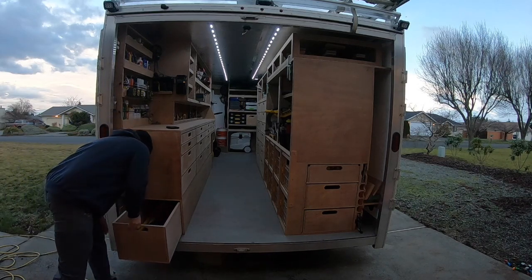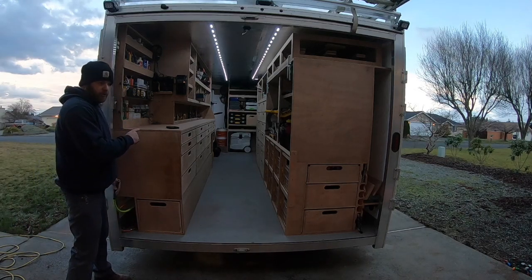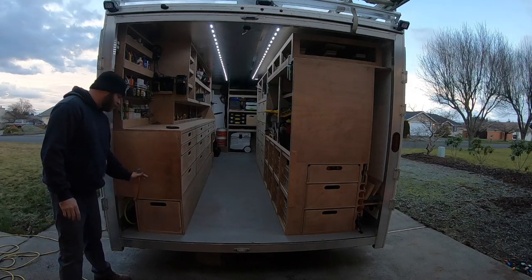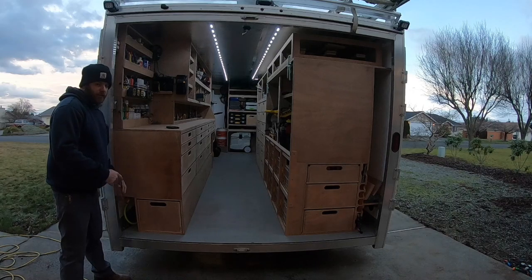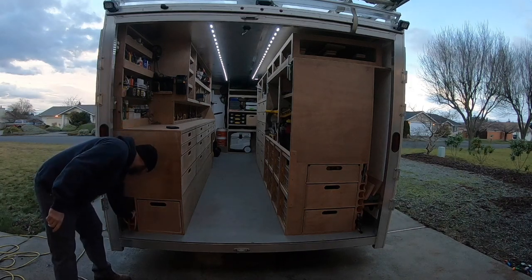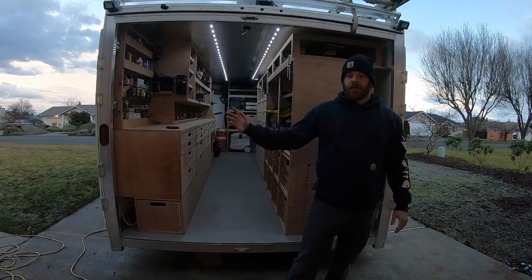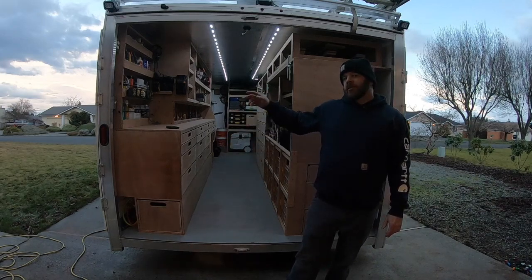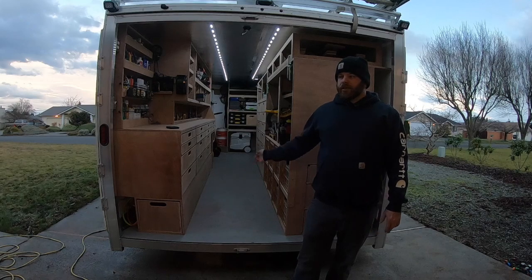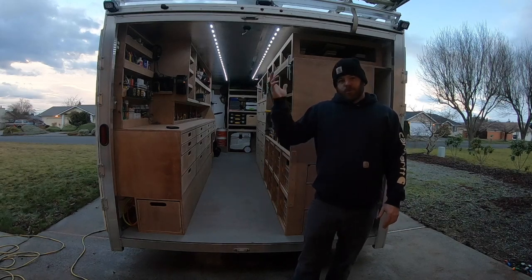This storage is eight feet long. I have air — you'll see later it's hooked up to a reel. I have 150 feet of air hose on a reel. Here's a power cord — a hundred feet, 10-gauge cord on a reel that I can run out of the trailer, plug in, and that'll power up the trailer. I also have a cord on the side that I can just plug right in and unplug. So I plug that in at night — it'll charge the batteries, both my cordless batteries and the battery that runs the 12-volt lighting. In the morning when I go to leave for work I can just unplug it; I don't have to open the trailer up or do anything else. And in the event that I forgot to unhook it, it'll just pull itself out and unplug.